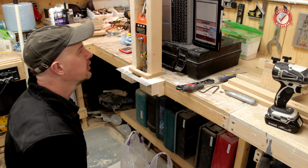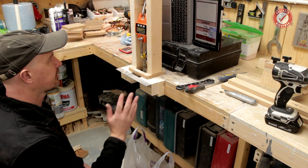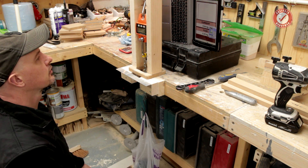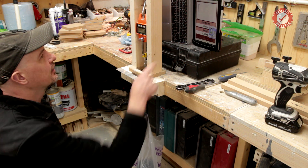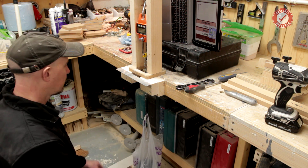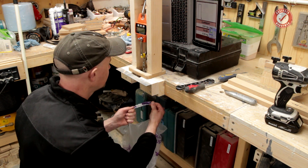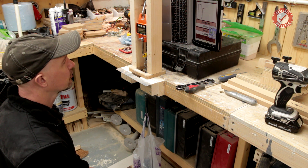I put the two kilo weights in a plastic bag, which I'm assuming is of negligible weight, so I don't really need to take that into account. I'll start with eight kilos and work down. I've zeroed the rig, accounting for the hook, and we're pretty much reading 8.01 — as near as damn it to eight. You can see the little wiggles in the graph; that's from the bag swinging. Coming out at 6.02, 6.01, 6.02 — close enough.